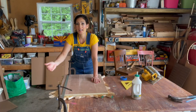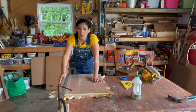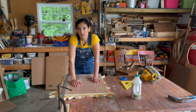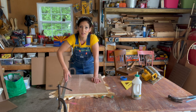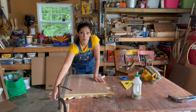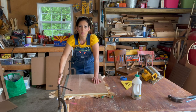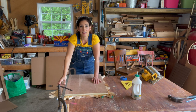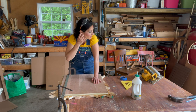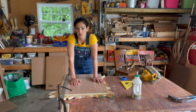I'm now at the point where this is dried and I can cut off those extra pieces. This is kind of a make-or-break moment. I've seen everybody else do them from the front and put tape on them. I was leery that I would actually be cutting into this back piece. So I think I'm going to set up this yardstick as like a track saw and take my circular saw. I went ahead and did do the tape. I've made sure that I have an allowance over top of the table so I'm not actually cutting into it. I was afraid I wasn't going to be able to judge accurately, and I didn't want to cut into this backboard. So I'm just going to give it a try and hope I don't ruin it. If it works out, I might implement this same thing on the other three sides.